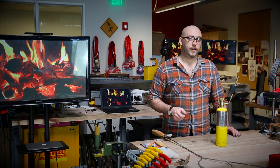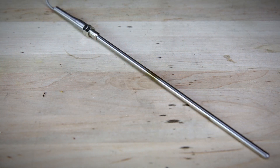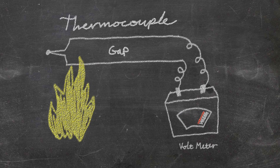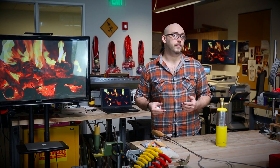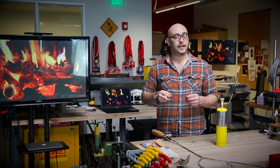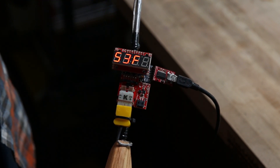It's November here in Colorado, and that means the weather's cooling off, the leaves are falling off the trees, and it's got me in the mood for a toasted marshmallow — which is as good a reason as any to talk about our new thermocouple probes and our new thermocouple amplifier breakout board. A thermocouple is a type of temperature sensor that works at very high temperatures, and it achieves this by using a bimetallic strip that actually generates a small electrical potential when one end gets very warm and the other end stays cool. You have to amplify this differential if you want to read the temperature off of the sensor, so that's why we also sell an amplifier breakout. This amplifier takes the very small potential and makes it large enough so that you can read it into a microcontroller. The nice thing about this particular amplifier breakout is that it not only amplifies that difference, but it also reads it out over SPI, so you can communicate with it using a serial interface and you don't have to have an open ADC on your microcontroller.